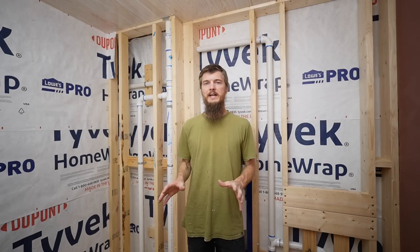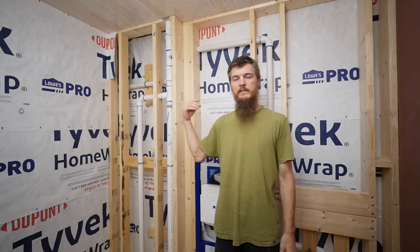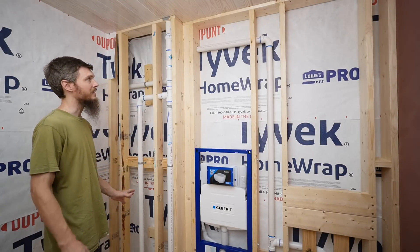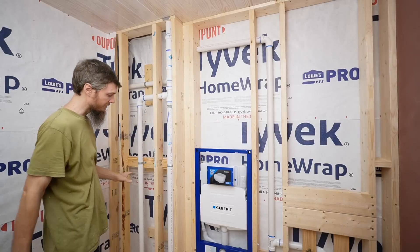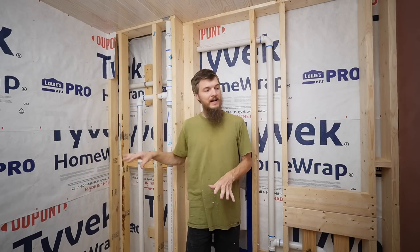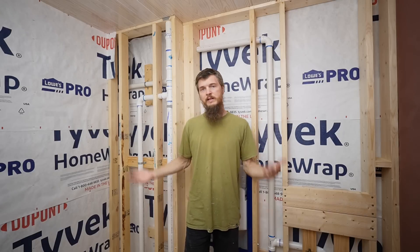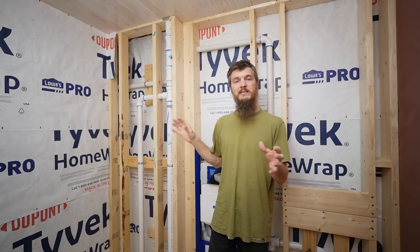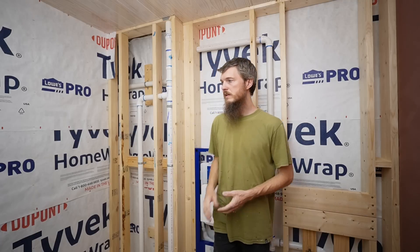While it was just a quick moment for you guys, we just spent the last couple of days finishing up all the plumbing. We had to run to the store and buy a couple of things we forgot the first time — that's always the case when doing plumbing, expect to go to the store a couple of times. We are done on the top end — all the plumbing in here, including vents, is finished so that we can finish the bathroom. I'm not 100% tied in at the crawl space yet because we don't want sewer gas coming up, but I wanted to get all the plumbing done so we could install the tub and start working on the walls.